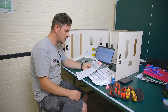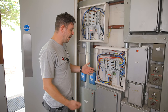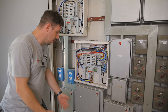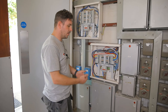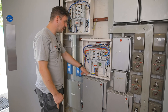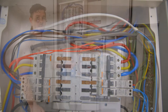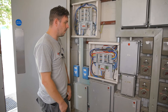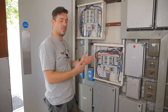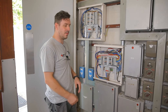With so many fuse boards in this installation we have to check a lot. For instance, we check that each fuse board is correctly identified and can be quickly switched off by the appropriate switch gear — and we're finding some of the switch gear isn't operating correctly due to the age of the installation. We're also noticing cables that have been extended, crimped, and joined inside fuse boards, and as the testing engineer I have to make sure all of this has been done to the appropriate standards. Detail is very important on a job this big because the report may be used by others rectifying issues at a later date.